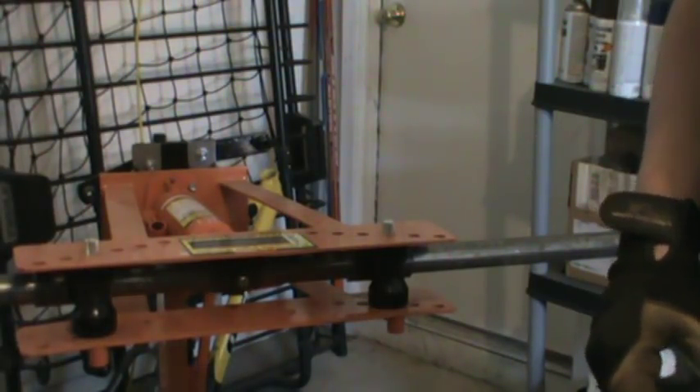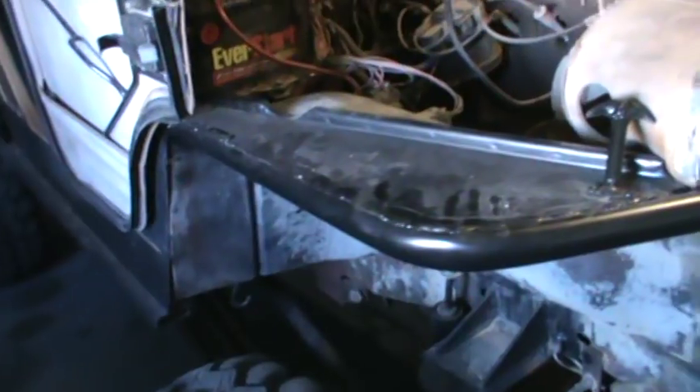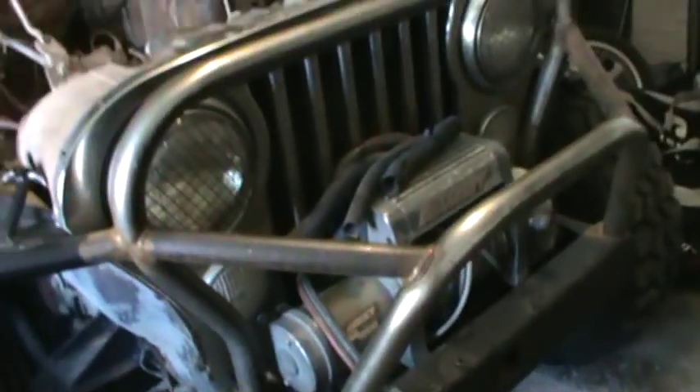I would bend this piece of pipe to show you it makes clean bends, but I don't want to waste that piece of pipe. I will show you a couple of bends I did make with it though. I built this radiator hoop — as you can see it's pretty clean, no bad denting in there. I also built these fenders — they look fine from the outside, but as you can maybe see, it is dimpled on the inside.